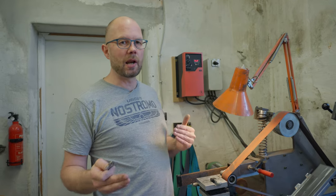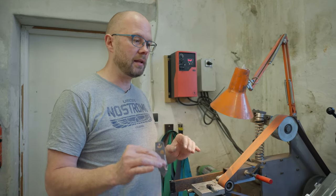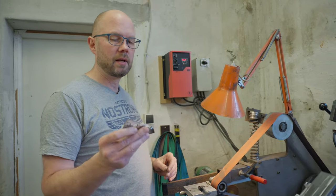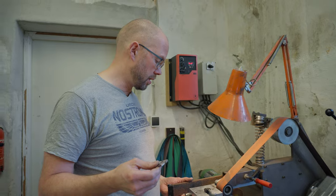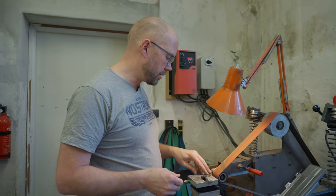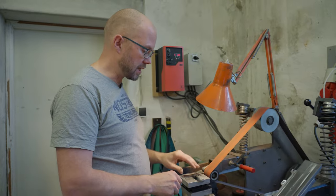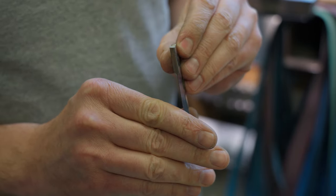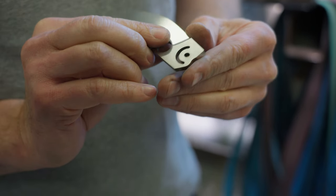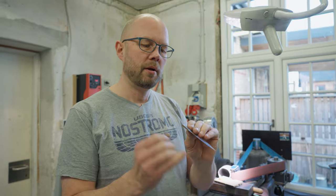Sometimes it's a lucky shot in a couple of takes and sometimes it takes 20 tries to get it just right. When you get it just right there's some micro adjustment that may be needed, but usually this gives me a pretty good indication of where I should be. Now I just need to deburr this sharp edge right here because it will dig into both the lock insert and the lock bar if not careful — it's a very sharp corner that just needs a little deburring.